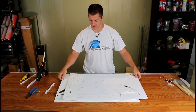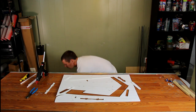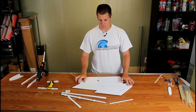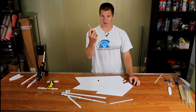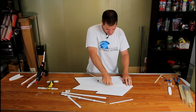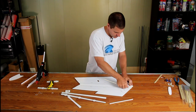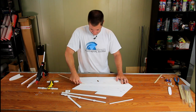We're going to build one wing panel at a time. First, fold the structure of the wing along the marked lines. Using a screwdriver or bamboo skewer works fine — simply press into the foam and drag down each line, folding the foam to make a crease that will fold over easily. Keep a relatively flat angle rather than standing it up; it seems to make the crease work a little bit better.